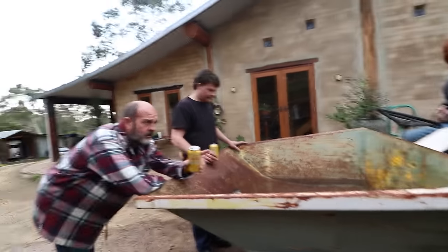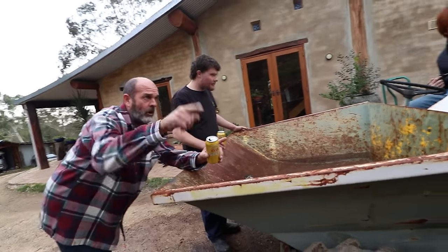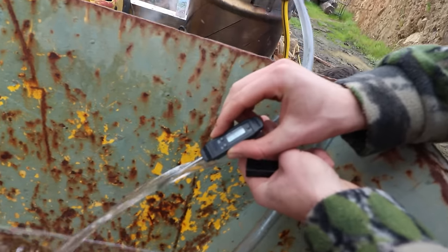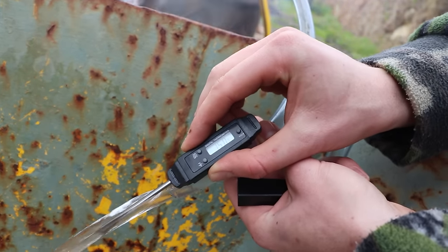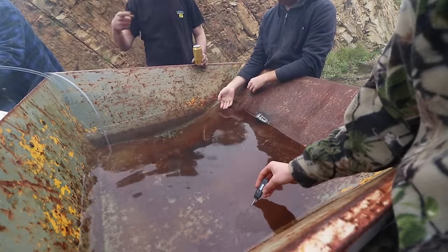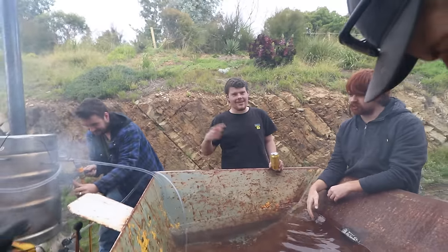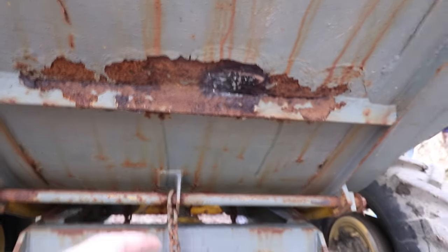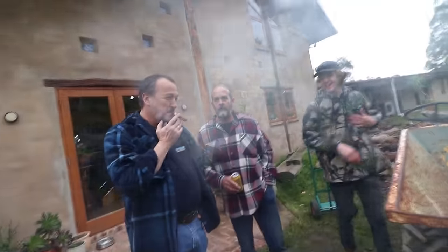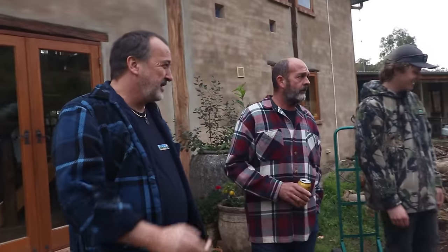So, inside there, what do you got? A series of copper pipes just running around? Yeah. Yeah, just these. Yep. Six of them. Rightio. Oh, we got 16 degrees now. It's going to require a good hour of circulating, probably. Yeah, more. I reckon, because it's not going to get enough heat just running through it. That's to circulate. Yeah. The question is not it's leaking now, the question is why, where was the ongoing maintenance over the last 15 years? That's my issue.